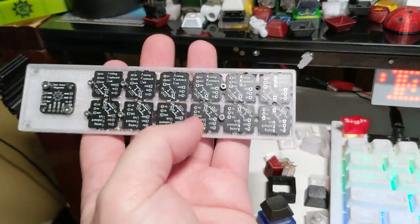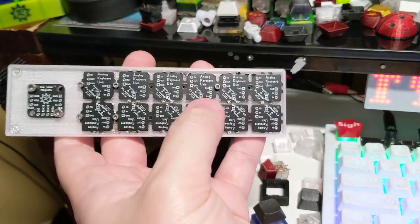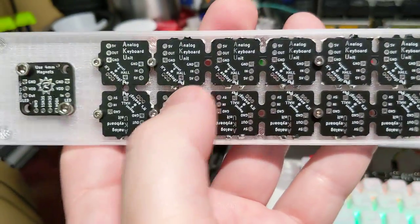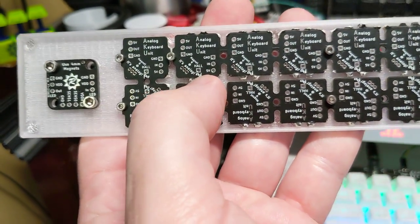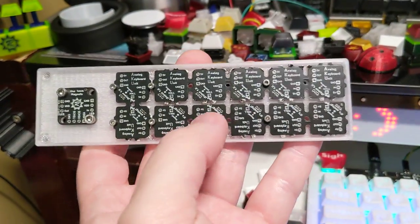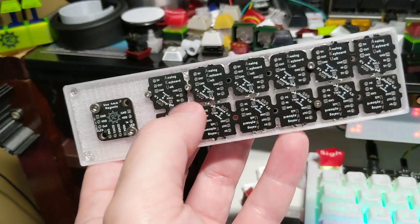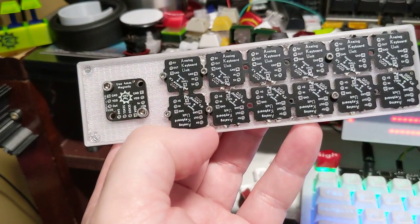In the next video I'm going to go into how I'm going to wire it. While I'm waiting for those screws to arrive, I'll probably solder wires into every one of these little Hall-effect signal pins — that's what that is, it goes to the Hall effect sensor. You can see it's got a little sine wave symbol. Before the next video I'll solder all the wires I'm going to need — wires out of every single one of these pins, and I need to run the output from here to the input on the next unit.